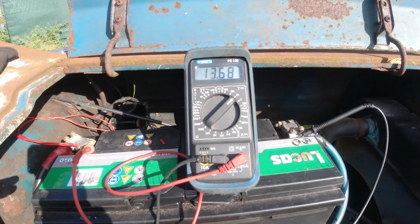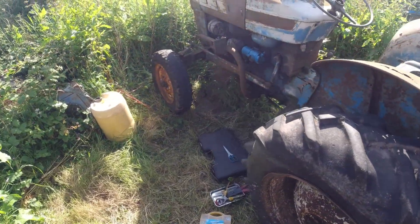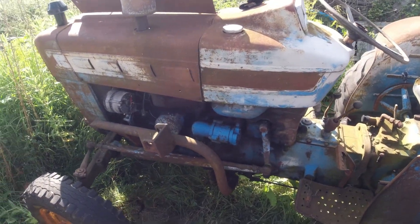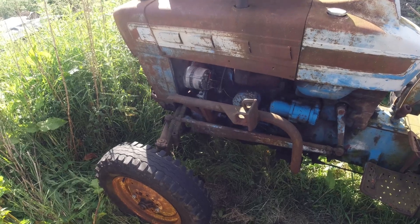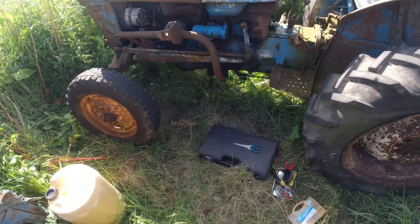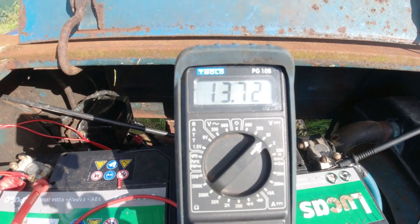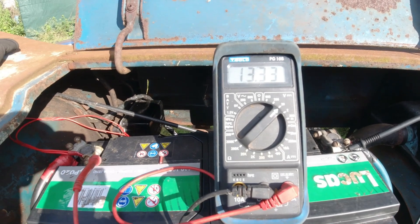The battery fell off. I suspect this isn't the world's best alternator — it cost me £10 from the Mini fair several years ago. The pulley size is probably wrong for this; the tractor runs at probably like 540 rpm for PTO so the idle is well below what it would be on a car, which idles at 750–800 rpm. So the pulley is likely too big and it's spinning too slow, but it's doing the job — it's better than that dynamo. With the engine off it's a lot quieter and you can see the voltage gradually decreasing, so that is all working.